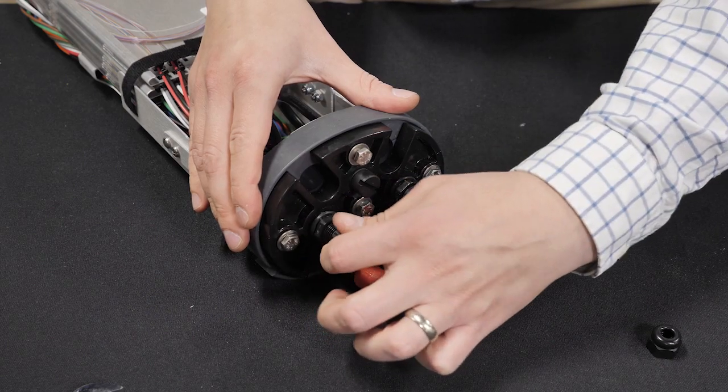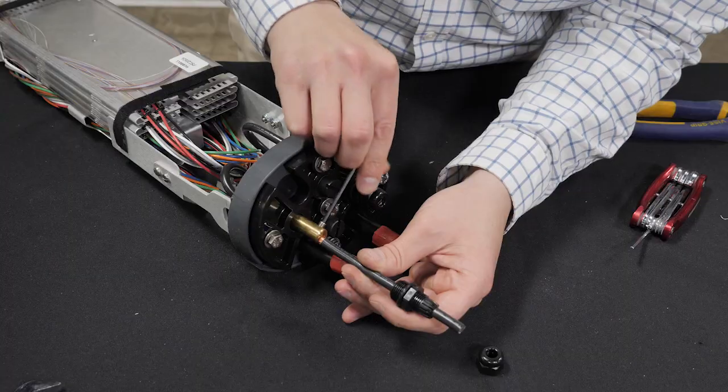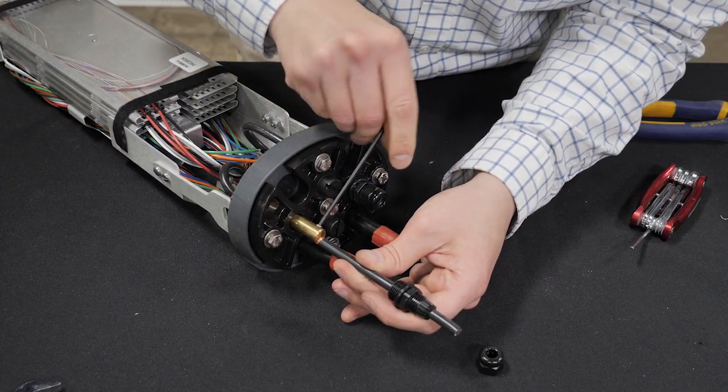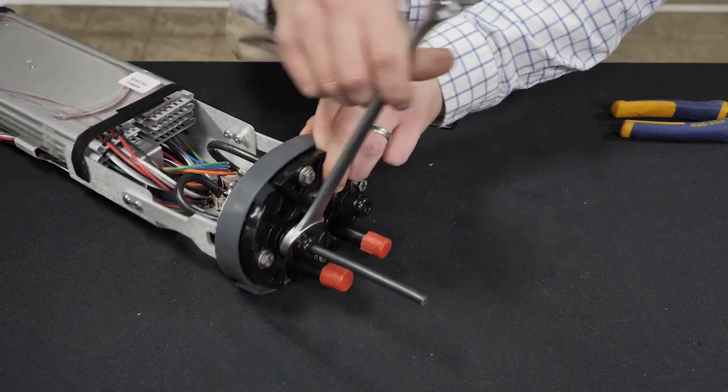Remove the outside of the watertight connector and pull through the ground rod. Loosen the set screw to prepare and insert the number 6 grounding cable from the OSP system. Once installed, tighten the set screw and reinstall the covers for the watertight seal.